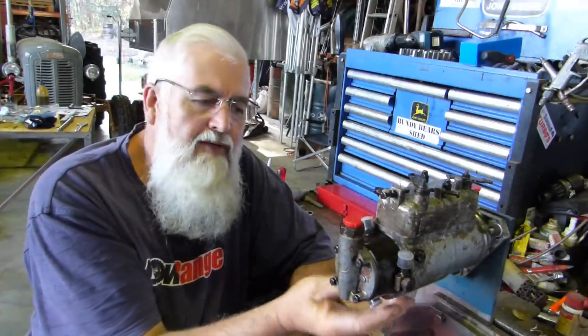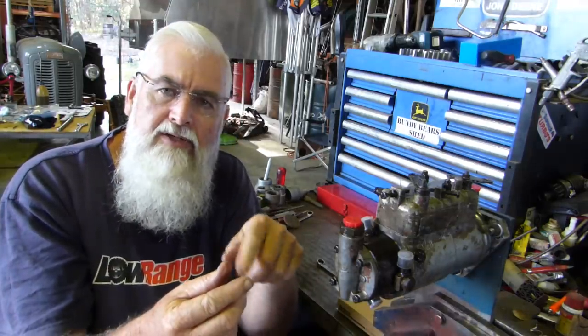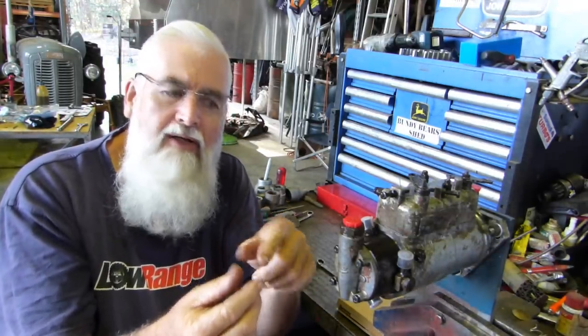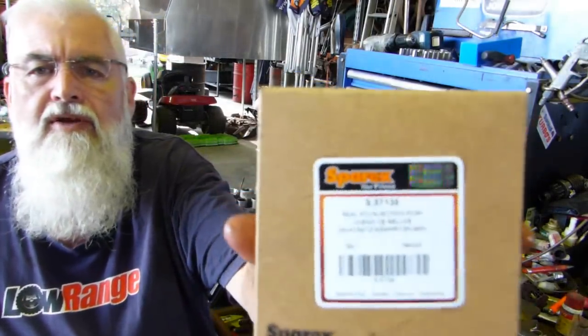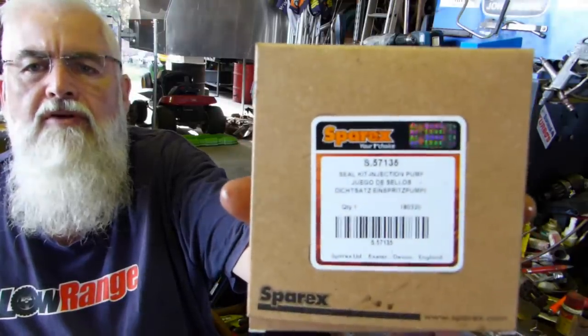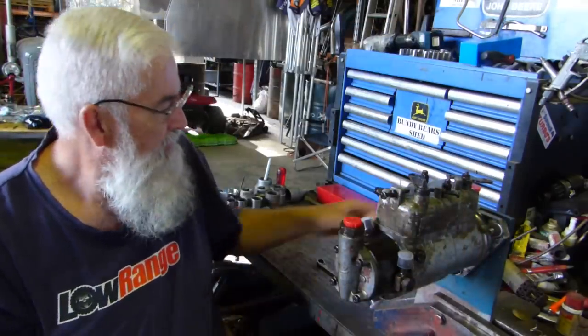We don't have the advance mechanism underneath on this pump. If you do have one - a small bolt and a big bolt, then a little screw that you can screw in and out, like on a David Brown - you just undo the screws and a spring-loaded ball will pop out the bottom. We're going to fit a Sparex S57135 seal kit. That's my preferred one; I've been fitting these for years, never a problem. They're a good kit. Sparex sponsors our channel a little bit sometimes, though they're not sponsoring this particular job.